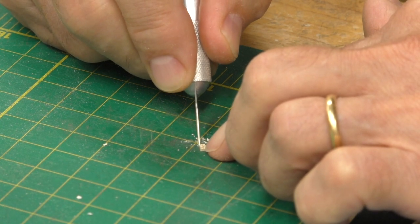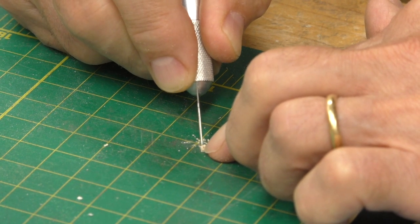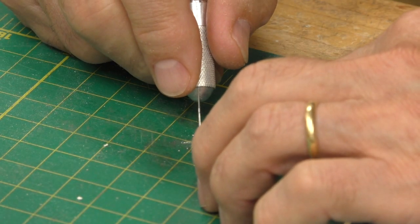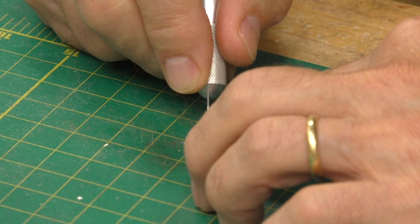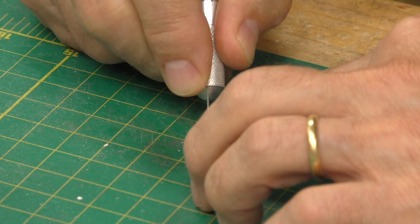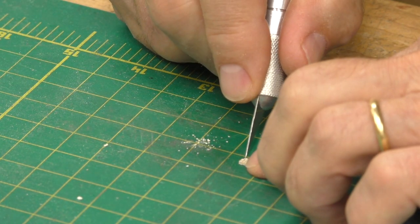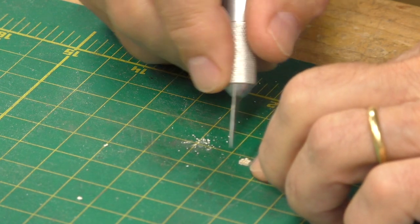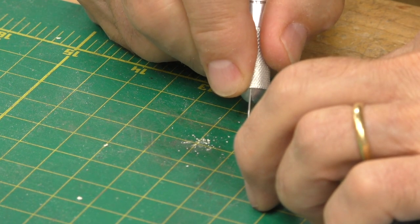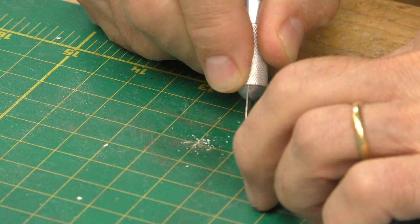You can score the line slightly, but I actually tried to cut this originally by scoring. And what I ran into was even scoring, if you put too much pressure on that score line, when you get to the last piece, that cross grain will just give way. So someone else may well be able to score it with a strong score line and break it out, but I had too many failures. When I first started doing these, even with the knife, I tried to do score lines, and I probably had a 30% fail rate. But I got so I could be about 90-95% effective with this, and it didn't take very long. On each one, on that one, I just nicked the edge and pulled a little piece across the top. I didn't mean to. Again, if you take your time.